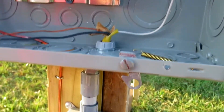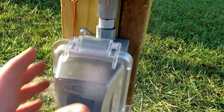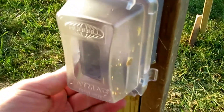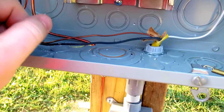That is just some of the requirements for getting this grounded. Now once you have all of that done you can tie in your receptacle. If you are familiar with electrical work it should be fairly simple. It must be a GFI, it must have a weather resistant cover — a good protective cover to keep it from getting wet. Then it is just standard wiring: our main lead to the breaker — a 20 amp breaker — then our ground going to the ground bar, and of course our neutral going up to our neutral bar. Fairly straightforward.